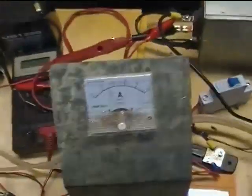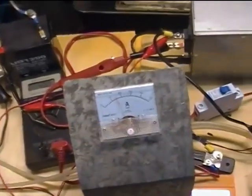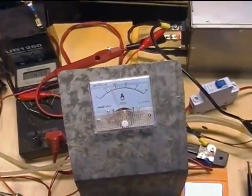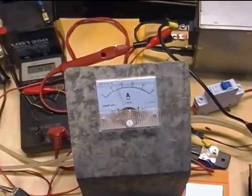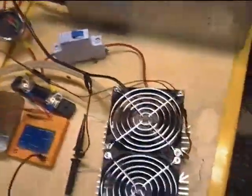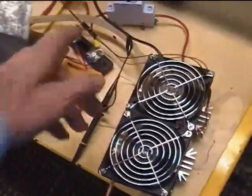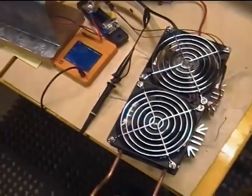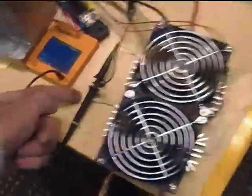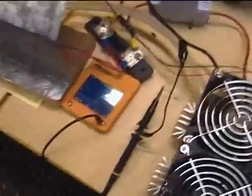The interesting thing for today is that the thing is drawing 15 amps idle, which is more than I'd like to see, but it's a whole lot better than the 26 amps I saw the first time I powered it up. All I did was take the fans and stuff off, look over everything, ohm out everything, and add wires here to bring out all the gates so I could see what the gates look like.